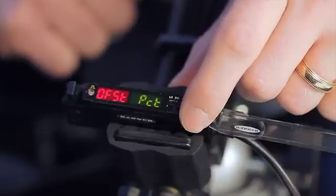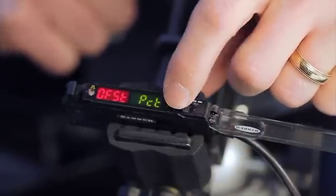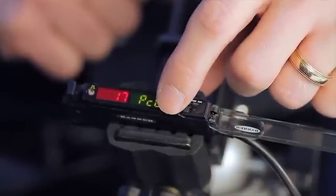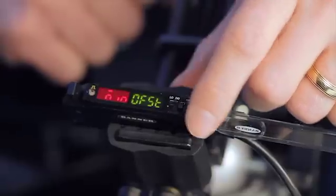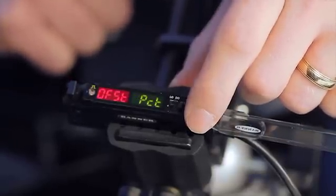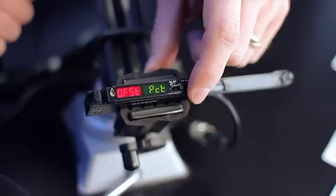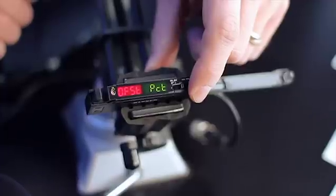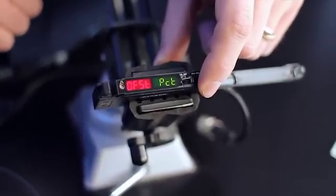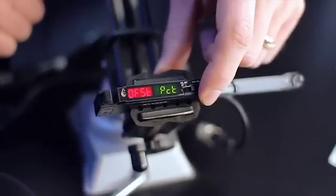The offset percentage for the light set, dark set, and window set can be increased from the default value of 10%, or by selecting the minimum offset option. The sensor will optimize each application with an offset as close to the sensor's noise floor as possible, resulting in hair-trigger switch points in stable sensing environments and larger thresholds in noisy sensing environments.